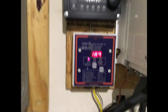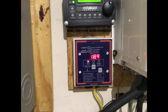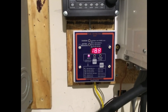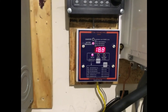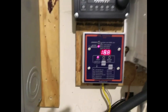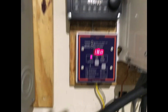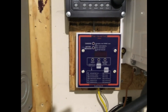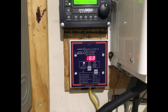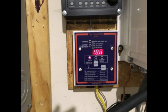It's the surge from the compressor that draws power to start up that motor. I've talked to some of you folks in the comments about something that will help in that regard. The only other thing I can think of is to add more batteries, but I don't want to do that if I don't have to. These batteries weren't cheap. For a steady draw I think we can do it and the capacity will be what I expect. But at this low voltage setting, when that compressor kicks on, it's just not going to happen.